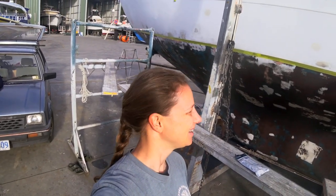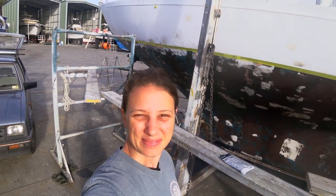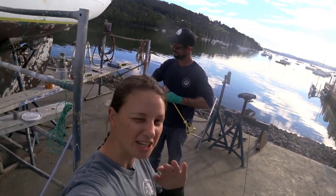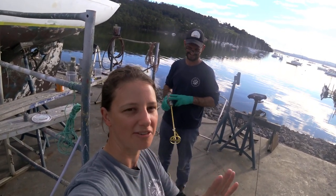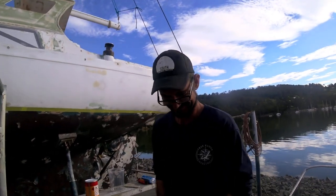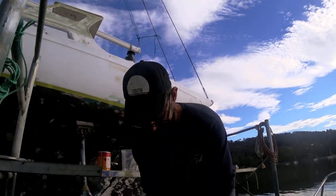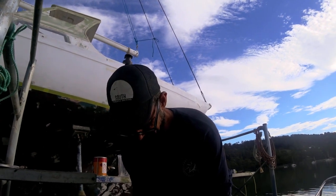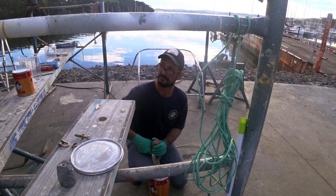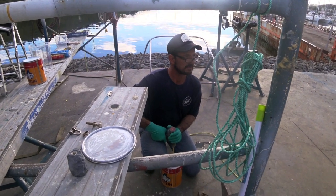Today is nice weather. We've spent the last hour prepping the topsides of the hull and we're going to put the first coat of paint on. Troy does not like painting and gets very grumpy, very frustrated with the finish, because these paints need time to let them dry flat. We're not putting a primer on the topsides because the data sheet says that as long as you key it to 180 grit — we've keyed it to 120 — it will accept itself again for re-coat. We're putting the same Jotun paint on again.